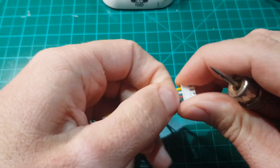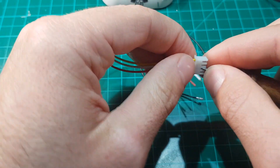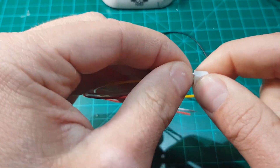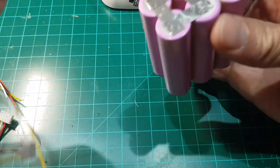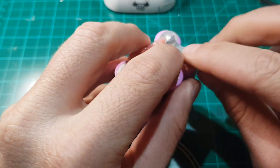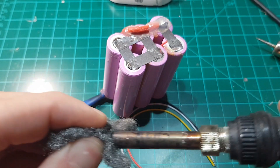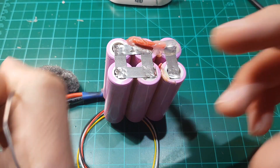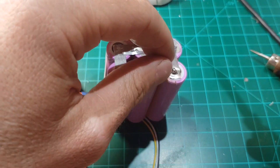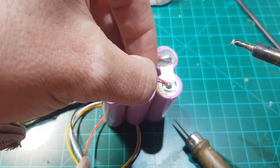I want you to go ahead and unpin all the wires from the connector, as many times they come wired incorrectly — we will reattach them later on. When performing this task, do not forget to reset the small locking pin on top of the connector. Now take the other end, trace it through the battery and all the way back to the positive connector. This will be the longest wire and that is the reason we are starting with it. Tin the wire, make a small solder blob on top of the positive terminal of the battery, and solder the wire. I am using the red cable in this instance because it is connected to the same side as the positive terminal of the battery, and then I follow the same logic with the other colors.